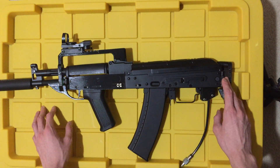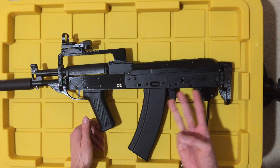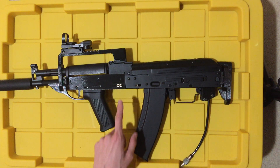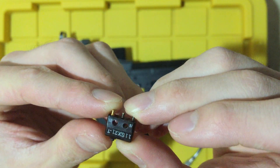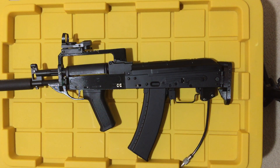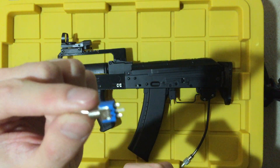Bill of materials. There is not too much that you actually need. You need a bunch of screws, and then probably the big kicker here is that you're going to need your own soldering iron, because you have to rewire this. You will also need three microswitches. Those can be found on Amazon. The one for the trigger is a Honeywell switch — it's a little bit expensive but it's what I had on hand. It's a really small microswitch with a tiny button on the bottom. I'll have a link in the description below. If you want the same toggle switches, you can find those on Amazon for about $10 for a bag of 10 or 20. You do have to be careful soldering these because they melt and break pretty easily.